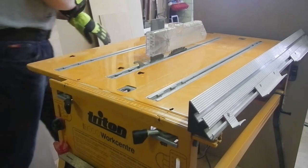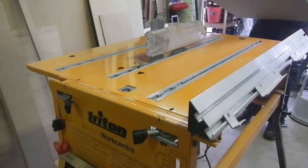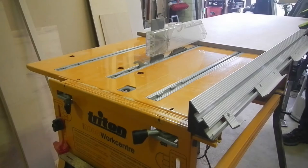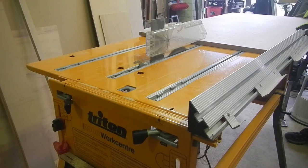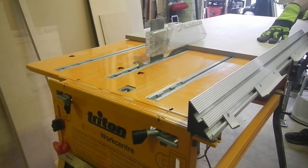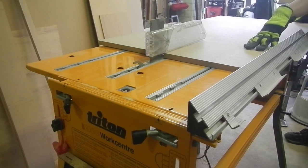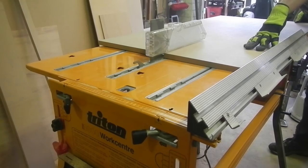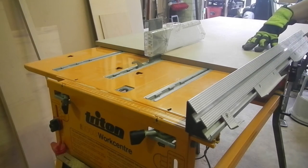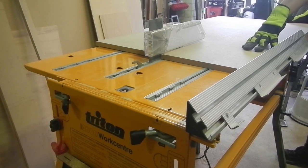Like I said before, I calibrated the blade, it's actually set 1 millimeter over what the ruler says, but that means I can sneak up on the cut. So yeah, here I am feeding it in. And I get probably about 20 centimeters into the cut and stop. And it doesn't go any further. So I try again, doesn't work, switch off the machine, and here I'm figuring out what's caught, why it's not going.